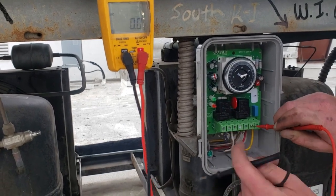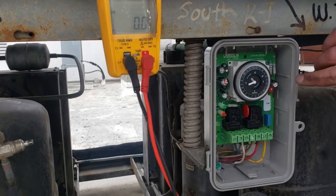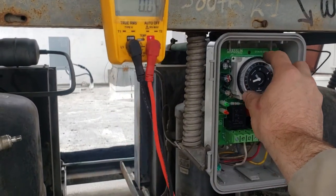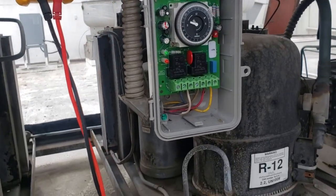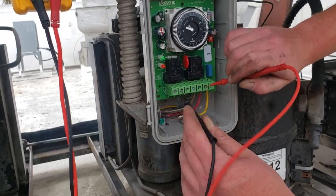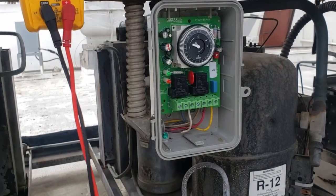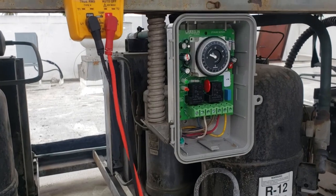Now put it in defrost. Just click the pins. Right, look at the triangle. Hold on, something's wonky there. Okay, now click it. Check 3 to N. 0 volt. Oh, well, it's cycling out of defrost because the X terminal's hooked up and it's warm inside that coil. More than likely is what's going on there. But why are we not in refrigeration mode is the question.